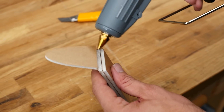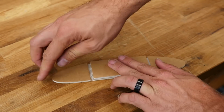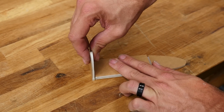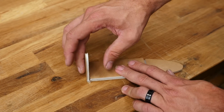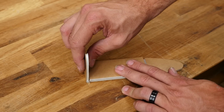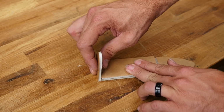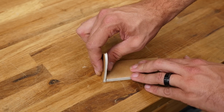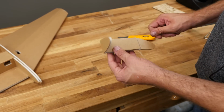We'll place our glue once again on the foam for structure. Back on the table. This time the side plate goes up and hold at 90 degrees and let it seat down. If you ever have a little glue squeeze out like that, just wait about halfway through the drying cycle and then move it away. You can easily scrape that up later. Anytime you have little glue globs on your table, they put dents in your airframe.